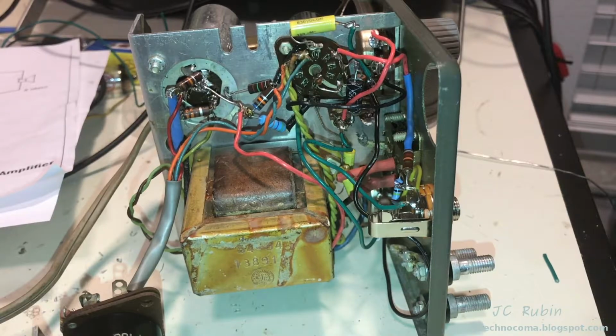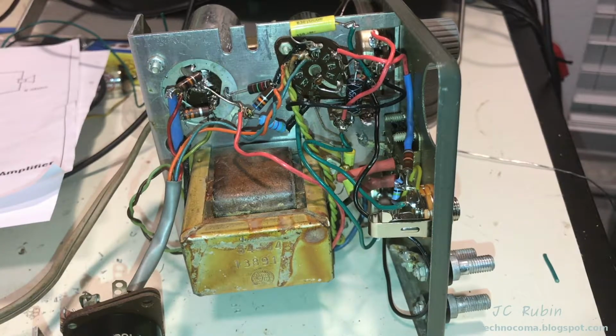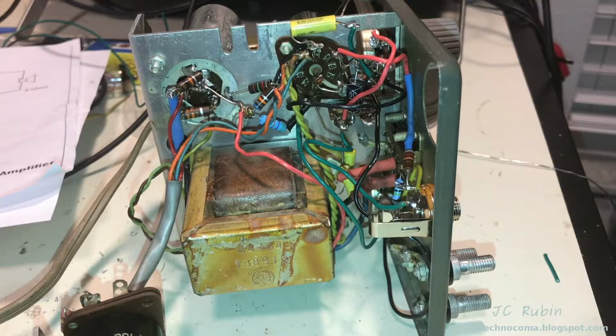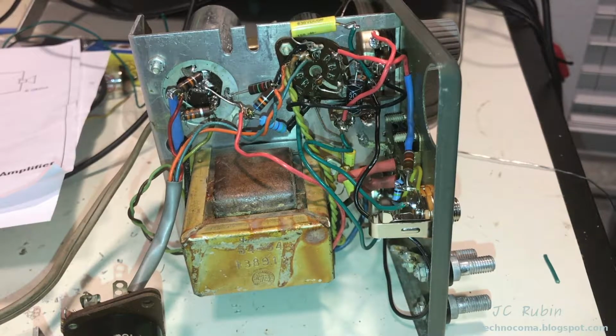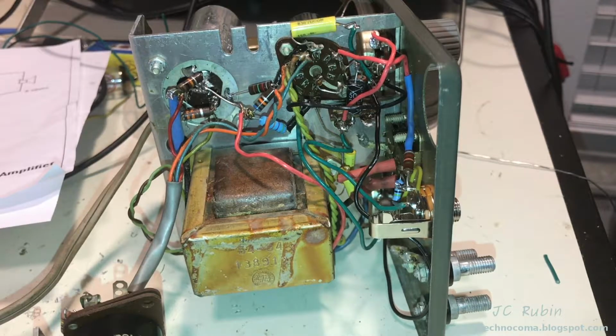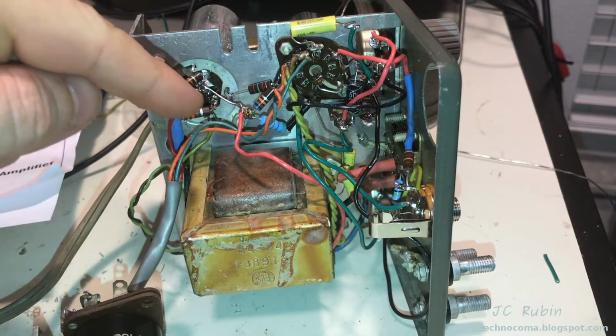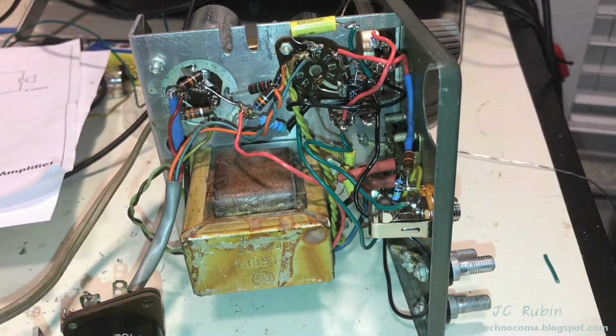Underestimating the voltage drop of the old rectifier versus the new one, and the cleaning up of the DC and the benefits from that, I was amazed to see how much the voltage had actually climbed throughout the circuit. It was substantial. So what I had done after seeing that was I said, wait, let's dial this back a notch. What happens if I bring this circuit back to the original configuration and take some measurements? And I'll tell you what I got.